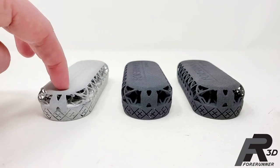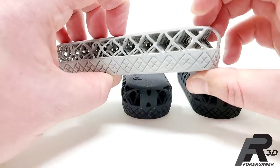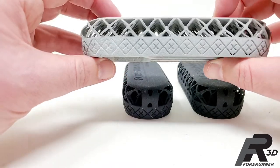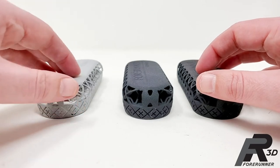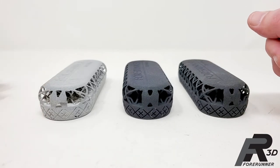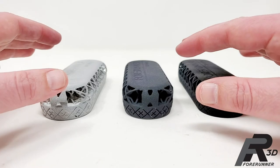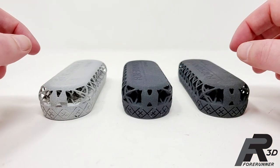One important thing to note: you'll see this one is actually broken — the lattice has snapped and cracked all over the place. There is a point where you can go too thin and start seeing failures inside your part. What we recommend is a design of experiment: figure out how much flex you want, but make sure you're not going to wind up with broken elements. You can go right from prototyping into production with additive manufacturing, but plan on a developmental phase to find the balance between the flexibility you're looking for and the durability you need. Durability is especially critical with lattice structures.